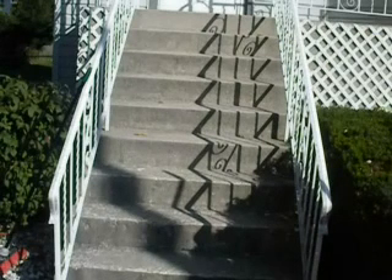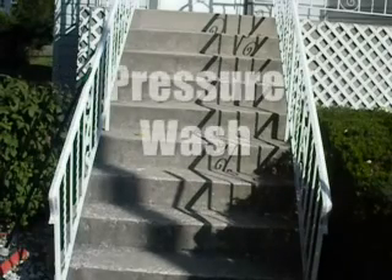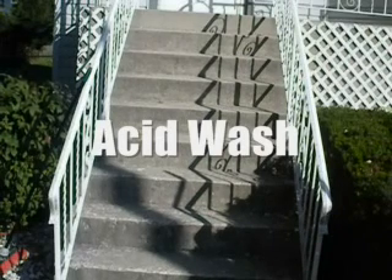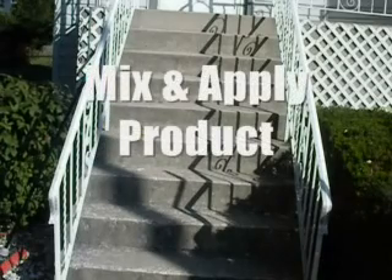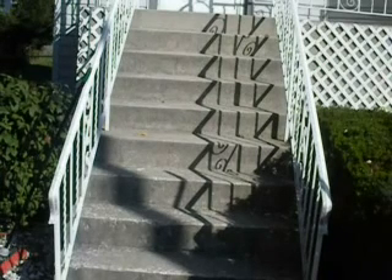We're in Brookfield, Illinois today. We're going to be looking at doing a rehab on these concrete steps. We're going to show you the full process front to back: a brief cleanup and sweep down at the beginning, an initial power wash to get rid of loose debris, then an acid wash to break the surface and make it more porous for the best possible bond. Then we're going to show you the process of putting down the ProSpec CR, the Concrete Resurfacing Polymer Modified Cement Mix. This stuff is fantastic.